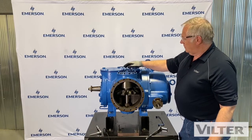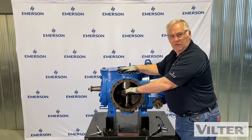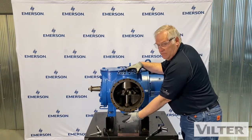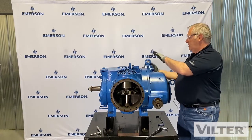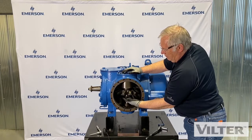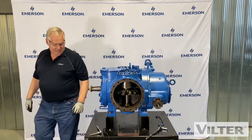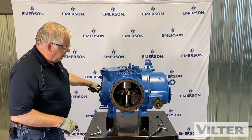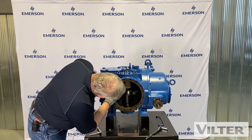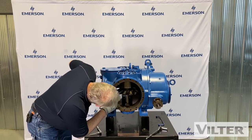I've taken some of these bolts out to make it a little quicker. But before we take this out, we have to position the gate rotor blade in the right place, otherwise it's going to be very difficult to remove or put back in. When we take this apart, we always take the large bearing off first, then the small one. On the reverse side, it's kind of mirrored — the large bearing is in the bottom, the small bearing is at the top. And this gate rotor blade will be flipped the other way. So we have to turn this rotor here until we get it in the right spot. What we're going to look for is the end of the rotor on the suction side — there's a tip of the rotor blade.